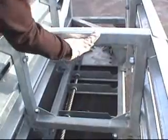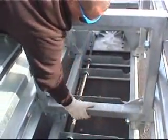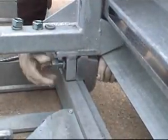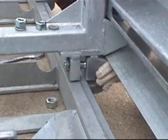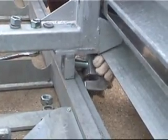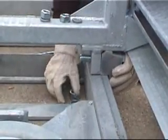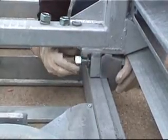Next, inspect the support frames. You should not see any evidence of cracking or bending. Pay careful attention to the upstops that hold the frames to the channel. The side guide bolts should be removed and inspected in the general impact area. These upstops experience the full impact of the vehicle, both laterally and vertically. They should not be bent or show damage.